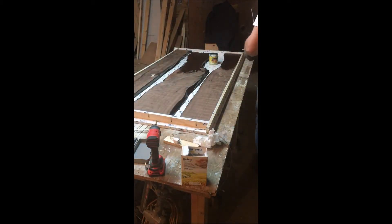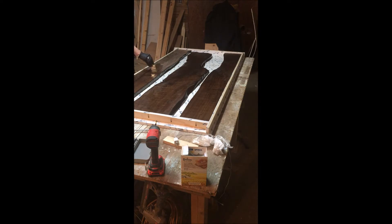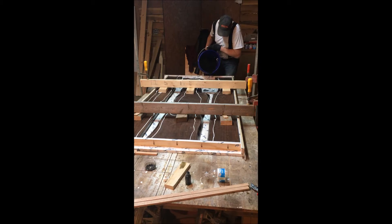We put a coat of shellac on it. I got that tip from Black Tail Studios — he's basically the river table master and kind of who inspired me to make this one. The shellac means that when black epoxy drips on that pretty black walnut, it doesn't get in there and stain it.